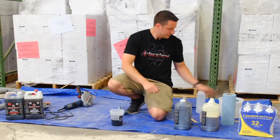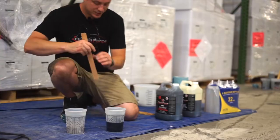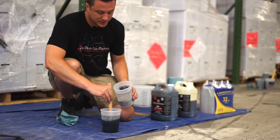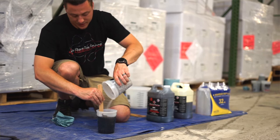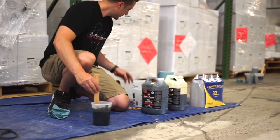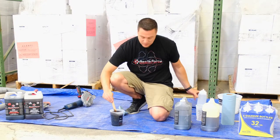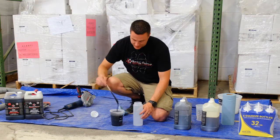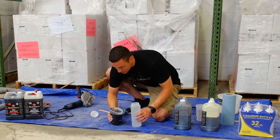So now this is already starting to go. I'm going to mix this for about five or six seconds and then start adding my sand. I'm adding in about eight — and if you want to go heavier, ten or twelve ounces of sand. One of the really nice features of this product is the sand stays suspended in the EasyMend. It'll sink a little bit, but for the most part it stays suspended like a slushy.